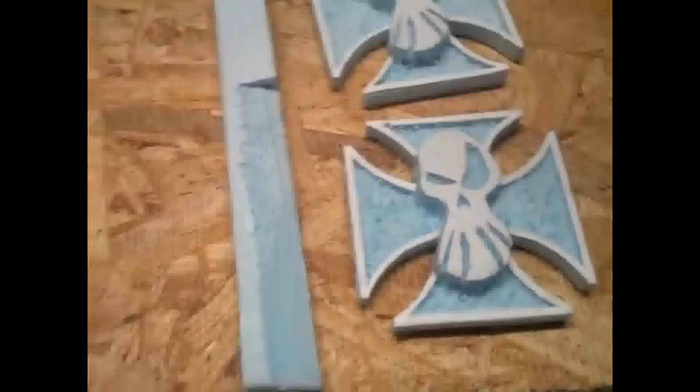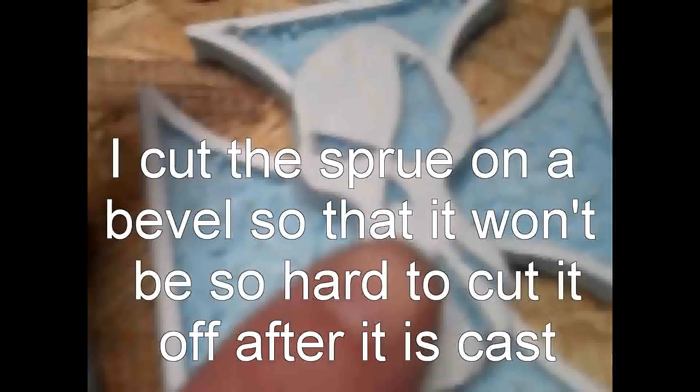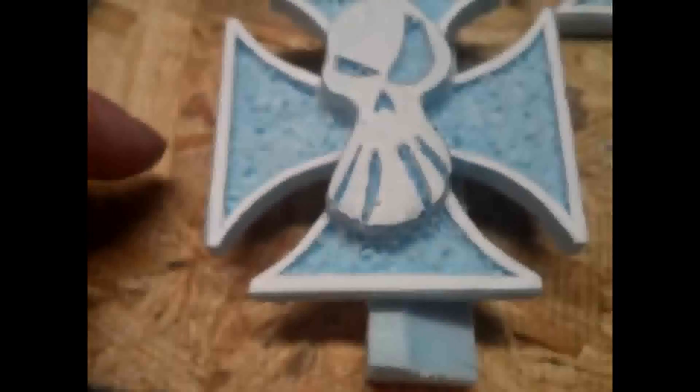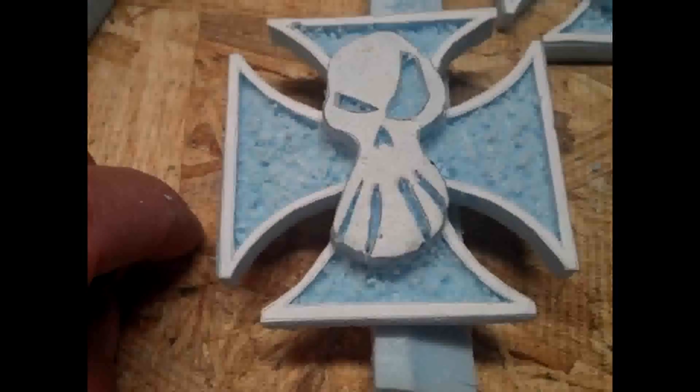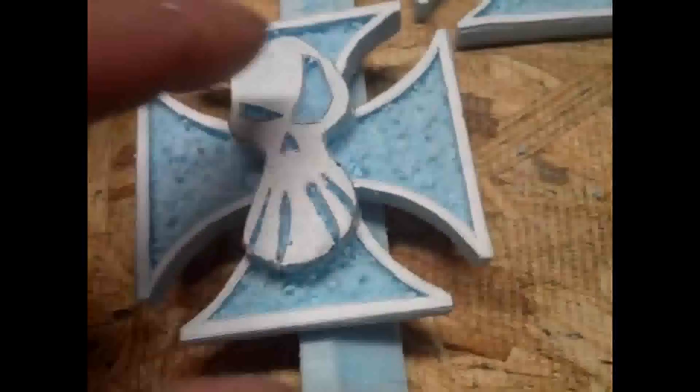The pieces are completely cut out, and now I need to mount them on my sprue. I'm using a sprue that's thicker than the thickest part of the casting, but I don't want to have to cut out all that metal, so I'm making it narrow here — doubling it — so the casting will be fed through just that narrow piece.